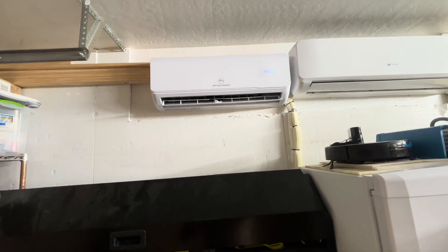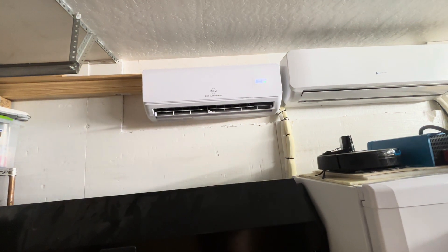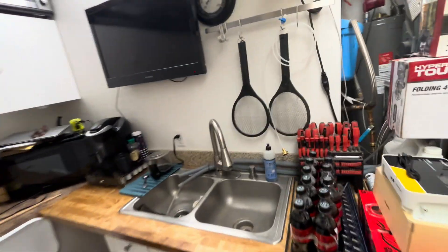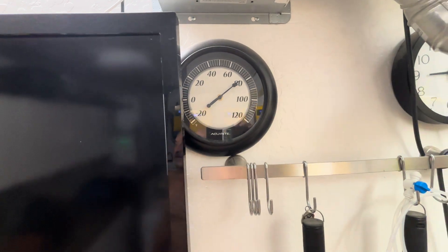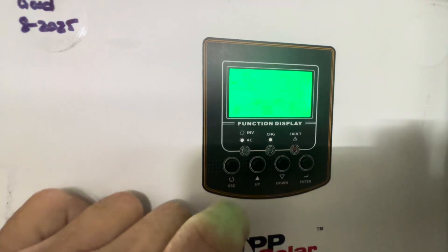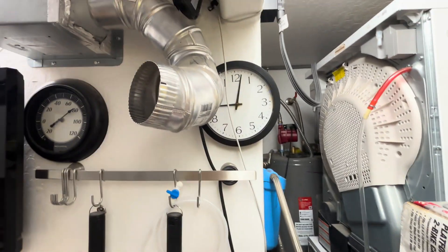There's no solar right now. We have 2,200 watts connected to that inverter, and we ran it on 86 degrees overnight in dry mode — and it's actually 76 degrees in the garage. You can see it's 76 degrees, and it's not even 9 o'clock in the morning. We're already bringing in 1.15 kilowatts and 42 amps. The batteries got down to about 45% and we're already back at 60%.